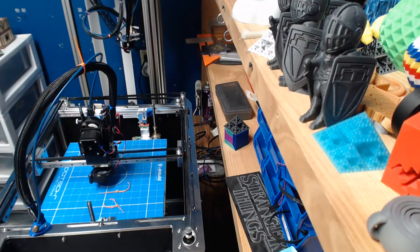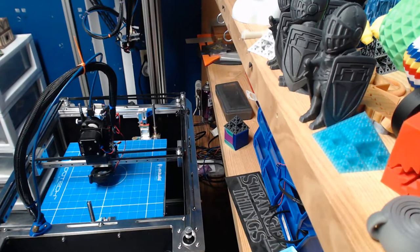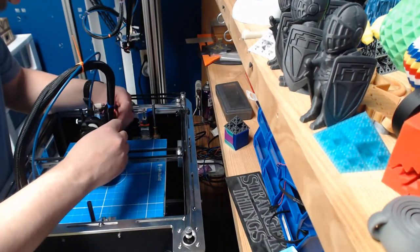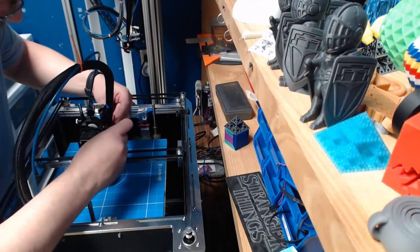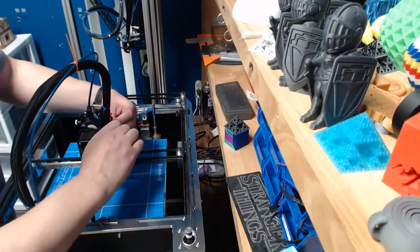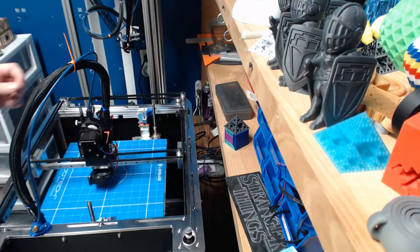The Duet filament sensor, I would give a solid C on an American education grading scale. I'm not terribly impressed, mostly because it's wildly inaccurate depending on what filament you run through it. The worst I've seen is the atomic marble PLA. My accuracy range varied between 10 and 130% of the expected motion to the actual motion